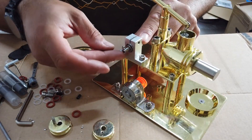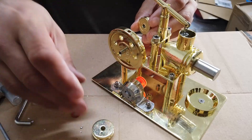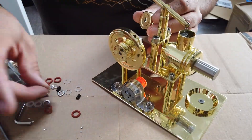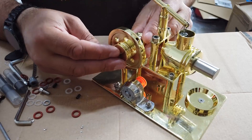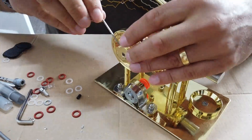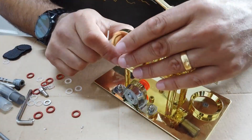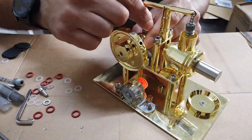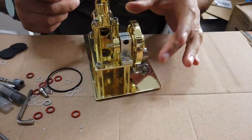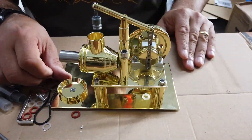As you can see we've got the two bearing races built into the bracket. We used a little screwdriver to pry the bracket open so the bearing races were easy to fit in. Then we select the appropriate wheels - one has a V-slot for a rubber band that drives the electric generator at the bottom, and one has a pin which accommodates the armatures for the pistons. Using some tiny grub screws we lock those wheels in place. There are also a couple of washers so the flywheel is stepped away from the internal bearing, which encourages smooth movement.